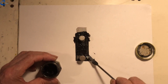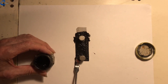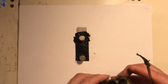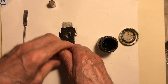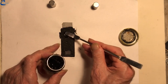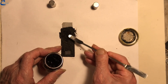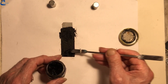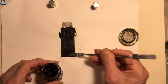With a spatula I apply the graphite ink to completely cover the stainless mesh, excluding the areas of the magnets. I then leave everything to rest for 3 hours so that the sealant hardens a little, but not too much. I then remove the two magnets and finish covering the areas that remained uncovered. Now the construction is finished; the electrode only needs to remain stationary 24 hours to allow the sealant to harden completely.